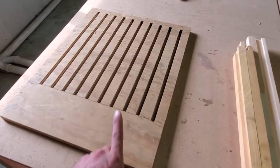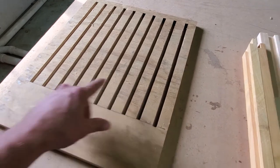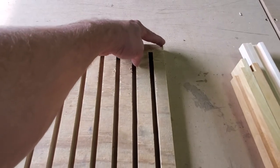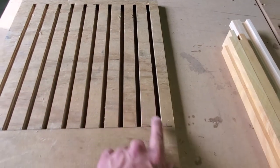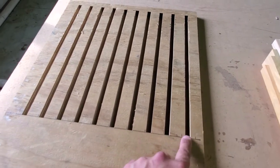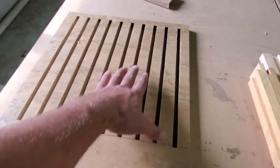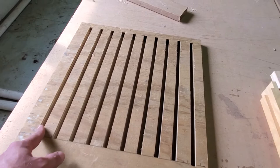After these are cut, I make a line here and drop the blade in, pushing it all the way down until it hits my mark on the fence, then I start pushing it this way, bringing the blade back. I've marked here at four and three-eighths inches, and that's basically where I stop the blade. Then on the fence you just move it over an inch and three-eighths, do it again, move it over an inch and three-eighths, do it again, all the way across.